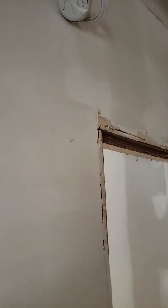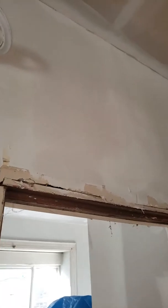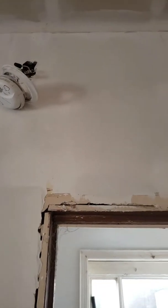You just brush those out, get rid of those lips, and it's all flat. Then it's two more very tight skims — same process, just leaving really tiny lips. The lips get smaller with each coat. But the most important thing is doing what I did yesterday: building up the areas that are humpy and making them truly flat first, before you start the skimming process.